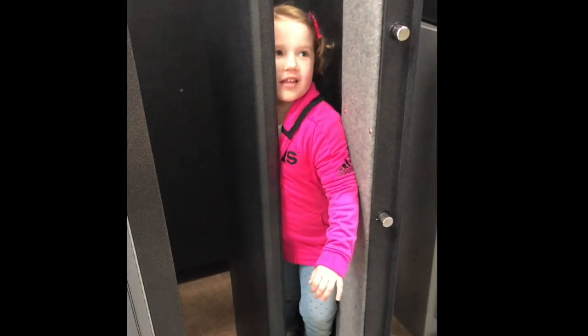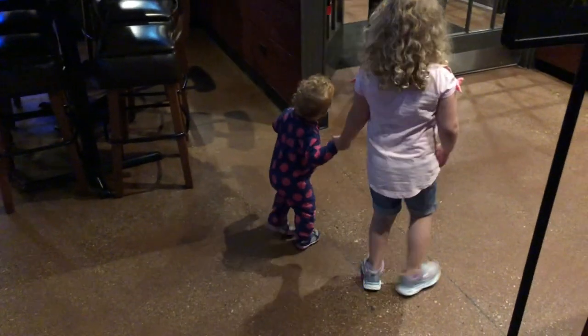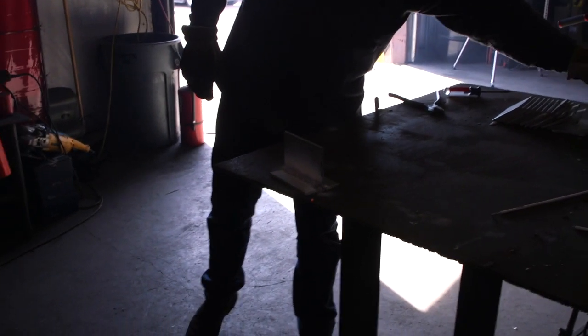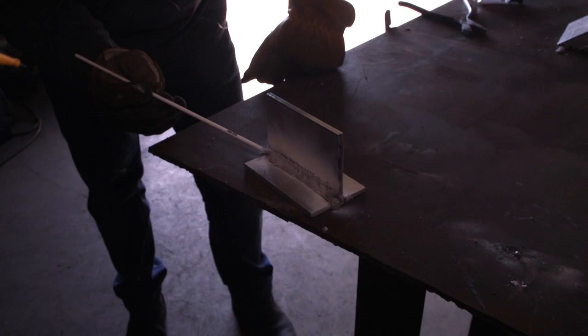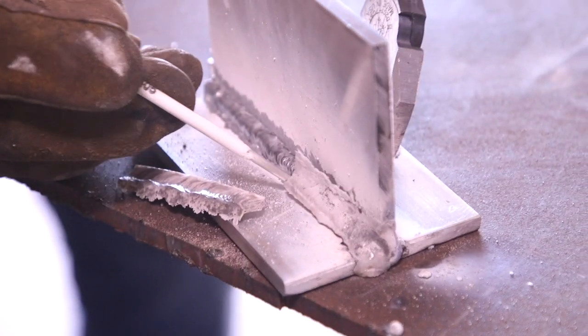Are you all curious to see what's going on? Come on, I'll take you by the hand and show you what great things are coming. Besides some stick aluminum welding here — that's an old thing you've seen on Weld Tube already — instead of having to beat the slag off like crazy, it's just peeling off all by itself, just flicking it off with a rod just like 7018. And everybody says it's not possible, so you came here to see the impossible.